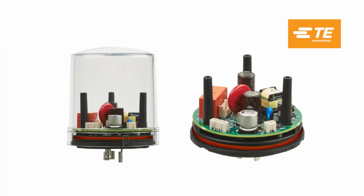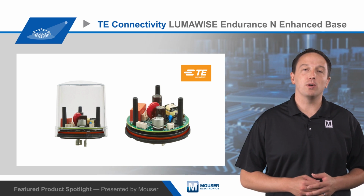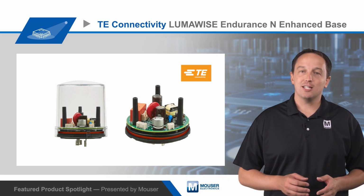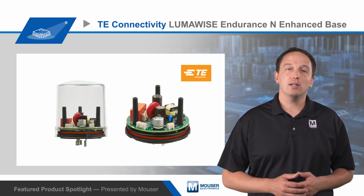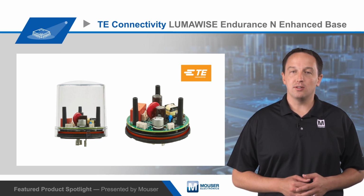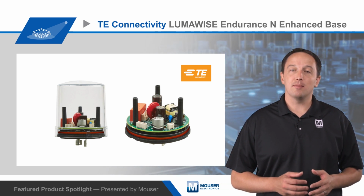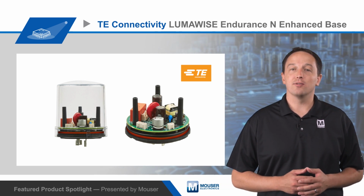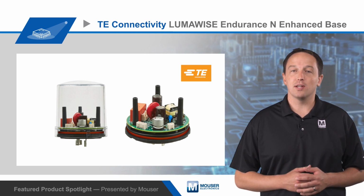The LUMAWISE Endurance and Enhanced Base is based on an 81mm TE LUMAWISE base assembly that provides a mating connection to an ANSI C136.41 dimming receptacle. The enhanced base also includes proven power circuitry, including AC power switching, surge protection, and multiple DC power rails. And with multiple enhanced base configurations using the same mechanical design and power and signaling interfaces, the platform enables cost-effective reuse of the control solution design.